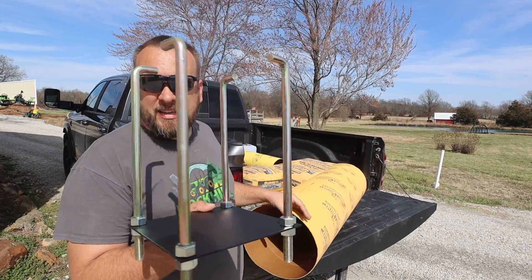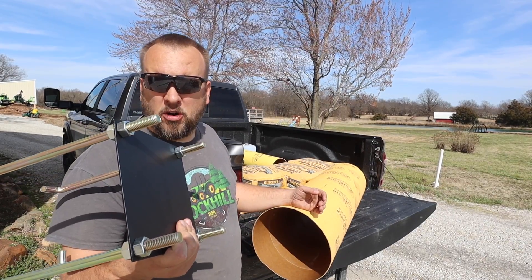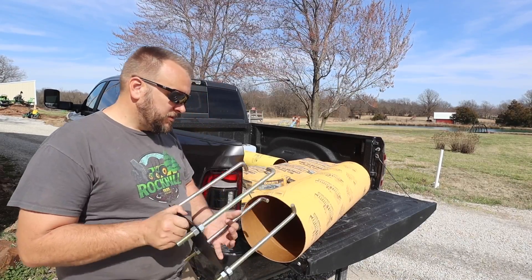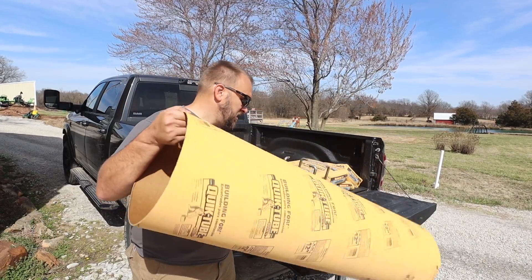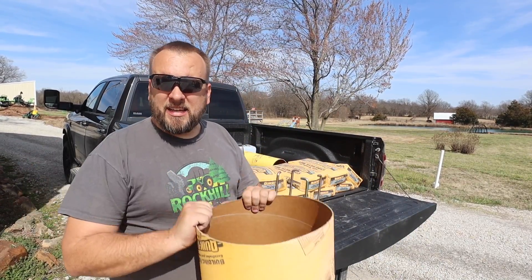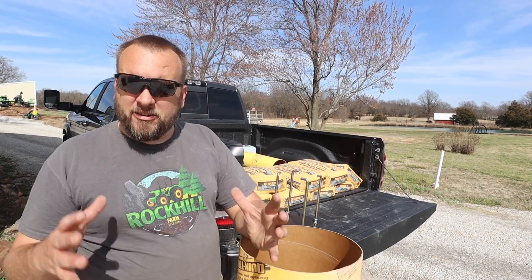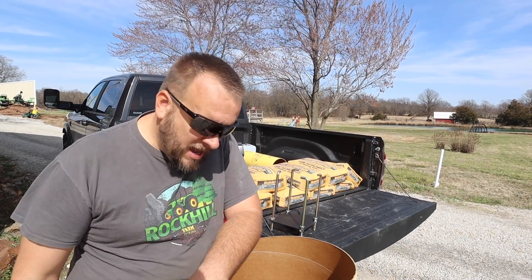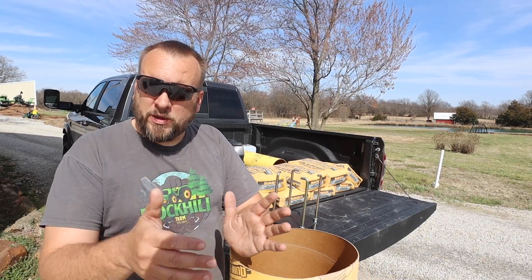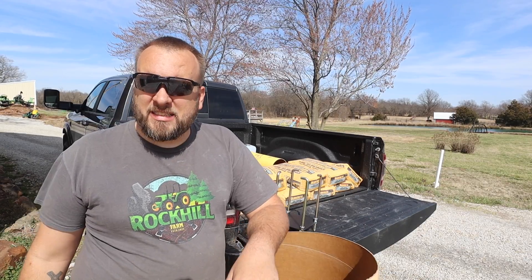What we're anchoring is this plate right here, and your pole for the basketball goal mounts on top of that, so it will just slide in once the concrete's filled. Using a sonotube gives you a cylinder that's less likely to heave and loosen than that pyramid shape. You'll also use less concrete because it stays in that exact shape, and there's a separation between the dirt and the concrete — because as dirt mixes into the outside edge, it's not as stable.